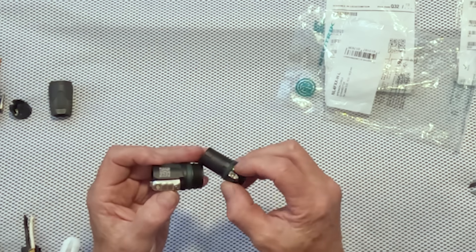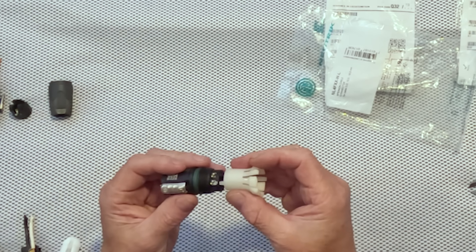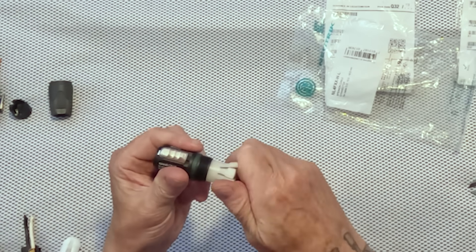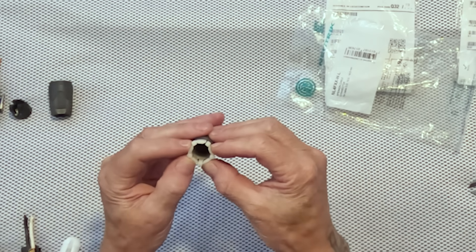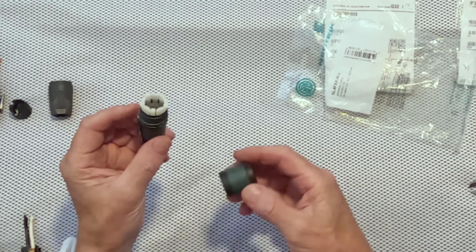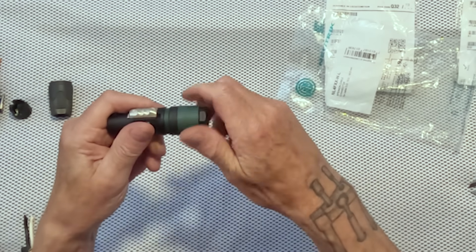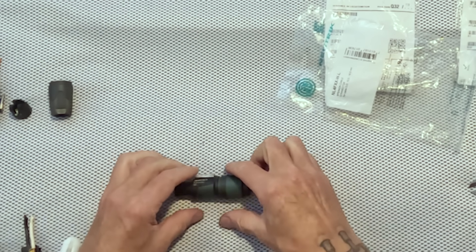Probably one of the biggest challenges with this new connector is the safety lock. There's also a rubber seal now. We'll go ahead and put this together. There's a green tab — this is a little larger — we line that up with the larger holes, then line the two tabs up, push it in, rotate to line it up, and push it all the way in. Now we've got this cable grip assembly. We can put it on the back and tighten it up just as before.